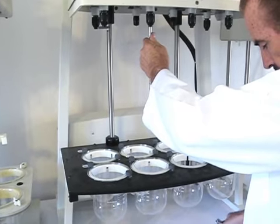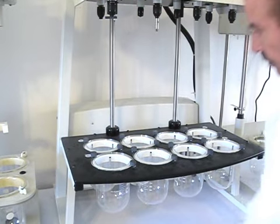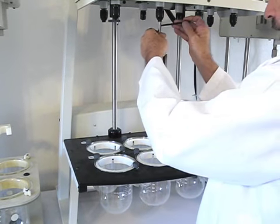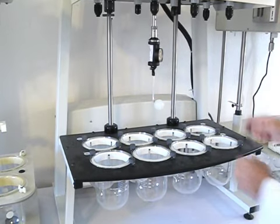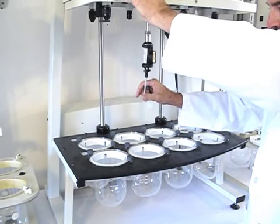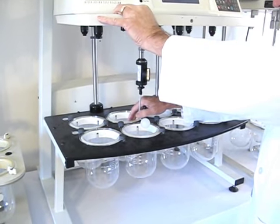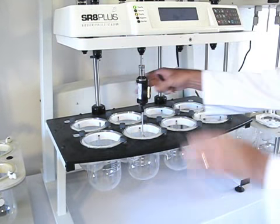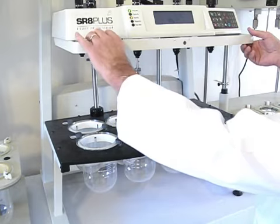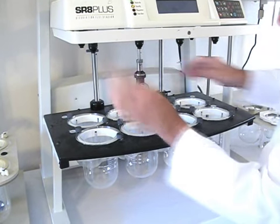With a Hansen unit it's almost the same thing: loosen the collet, install the surrogate shaft, tighten the collet, and install the gauge. Everything is serialized. One thing to point out: when you lower the drive head, it's a good idea to deflect the gauge with your thumb so it doesn't make hard contact with the vessel. It does have a big ball for easy engagement, but it's still much better to retract it first, and once engagement has begun you can release it. I'm now up at the top of the vessel and will set it to 40 again as a starting reference — there's no real zero on this gauge, but 40 is that position.